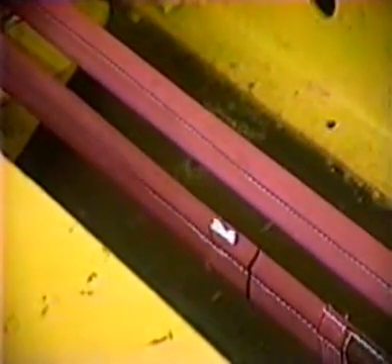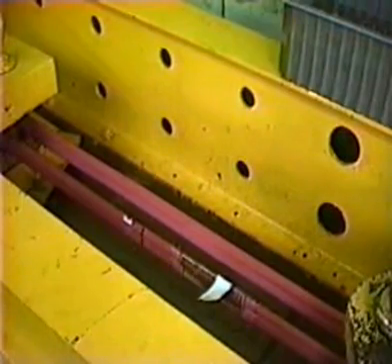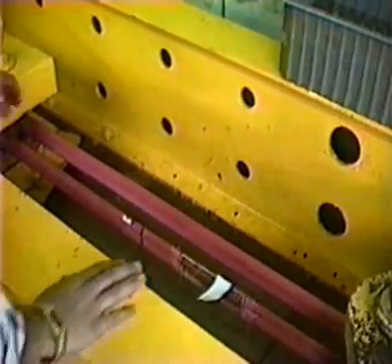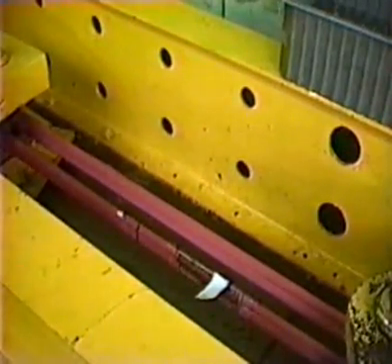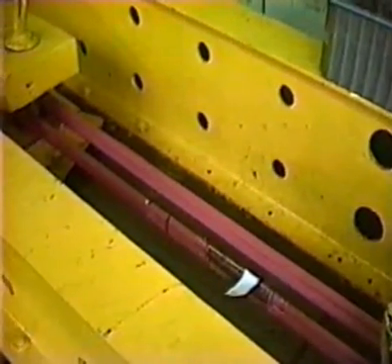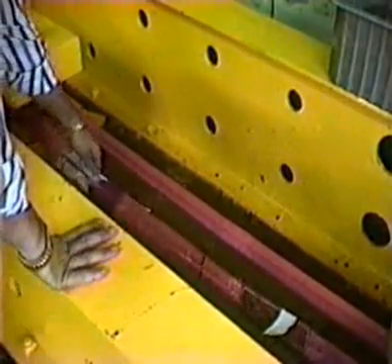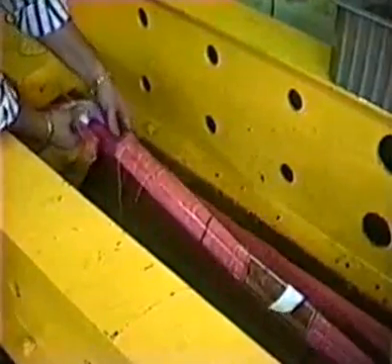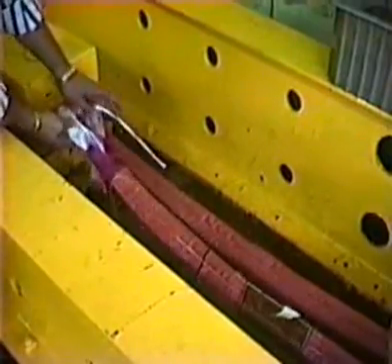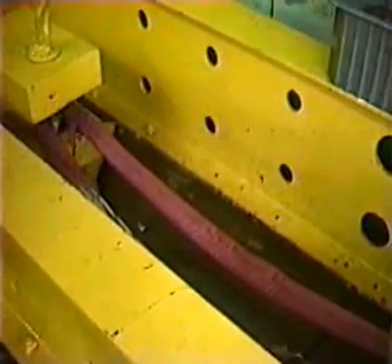Some damage on the cover, red core visibility, same here — tattletale gone. Let's go ahead and load her again to see what we can get. We're at rated capacity. No other sling would survive this. 25,000 pounds. 30,000 pounds. Now you can see obvious yarn visibility, which is criteria for removal on any of the soft fiber slings. You can see the contrasting colored covers and the internal load-carrying yarns, which are spectra made by Allied Signal Corporation.